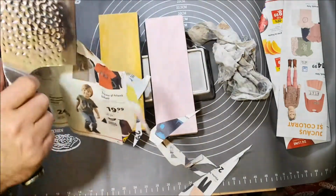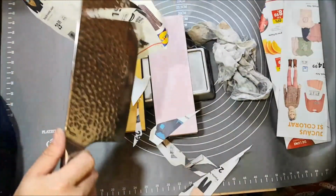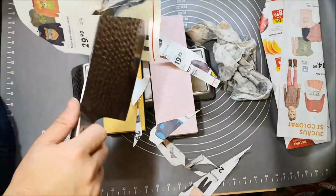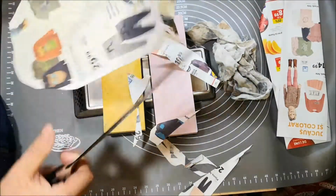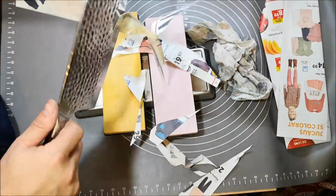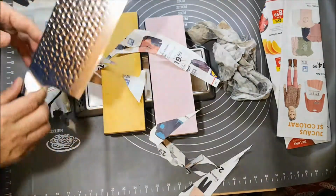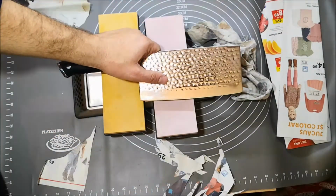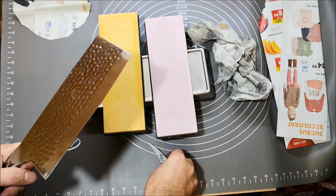So anyway, the knife came out pretty good. It's not a cleaver, it's a knife. So I'll tell the guy now, it's not mine. I'm going to sell it to somebody, and I've already told him, hey, watch out, this is not a cleaver. It has a very, very good steel in it, about 60 to 62 Rockwell. I mean, very, very hard steel, but very hard steel gets a very, very nice edge. The edge keeps a very nice edge with time, but the problem is, if you're not careful with it, it will chip.